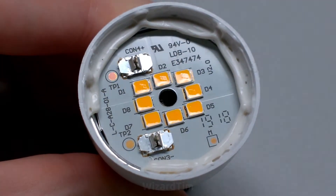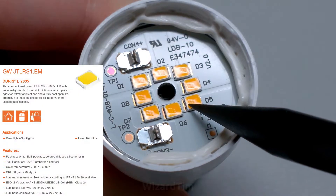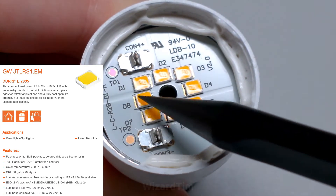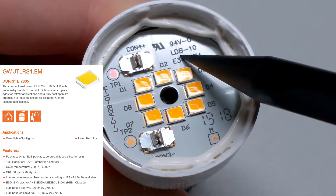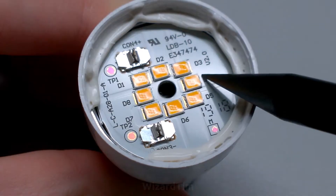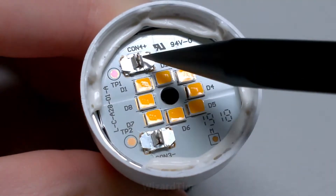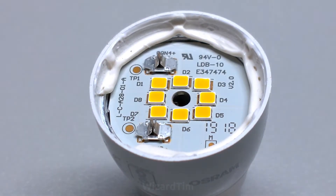Now looking at this aluminium core PCB, we can see there are eight LEDs on board, and if we look closely at them we can see there are three pieces of silicon in each chip, so these are probably nine-and-a-bit forward voltage LEDs, which allows them to use so few LED packages operating at a reasonably high voltage. We can see that these LEDs are connected to rather large copper areas on the PCB, which presumably helps with heat dissipation, although interestingly they don't use the same side of the LED package, so I'd imagine some of these would fail before the others.